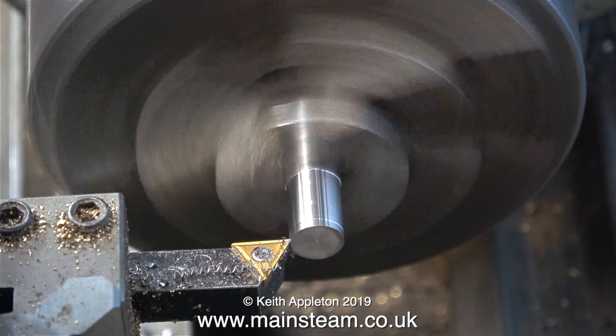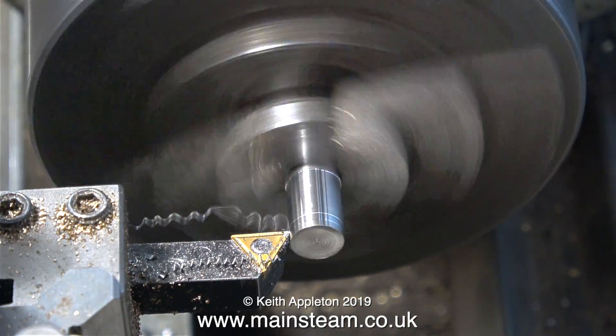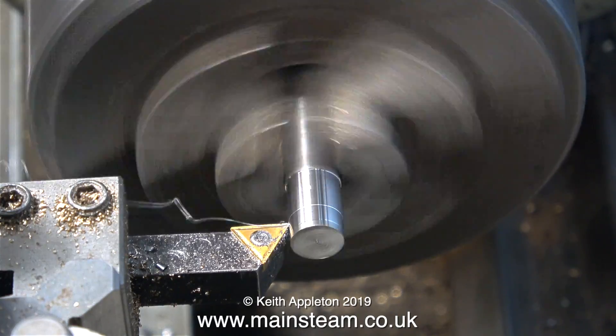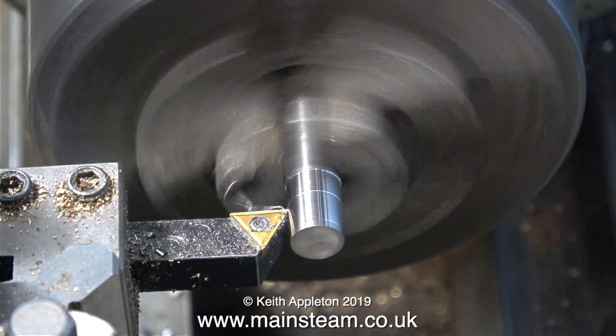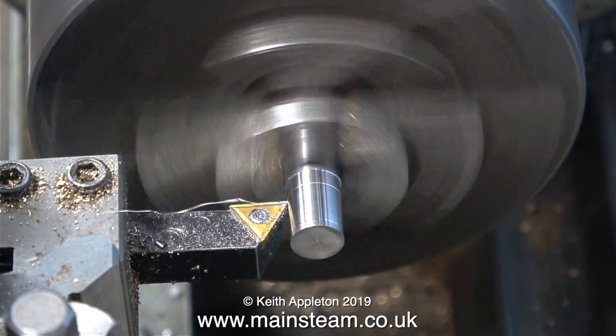Of course, this means that if you run out of Loctite 603 on a Saturday evening and can't get any until Monday, it's not the end of the world — you can do it this way. I don't need to use a micrometer for this job; I just keep putting the original pulley up against the work and I can tell how much more I need to take off. This once again is down to experience — it's not a talent, it's not a gift from God, it's just a case of practice. The more you practice something by repetition, the better you get at it.